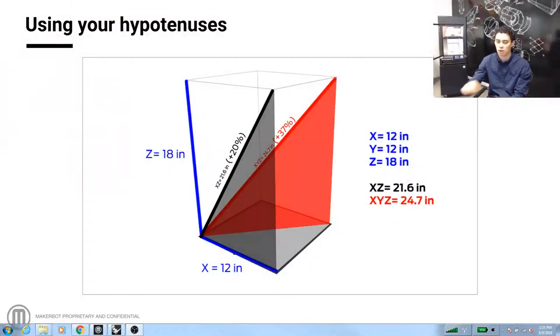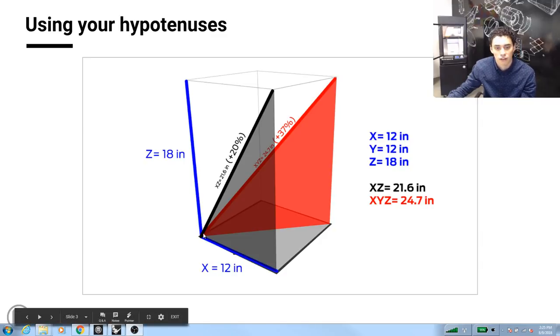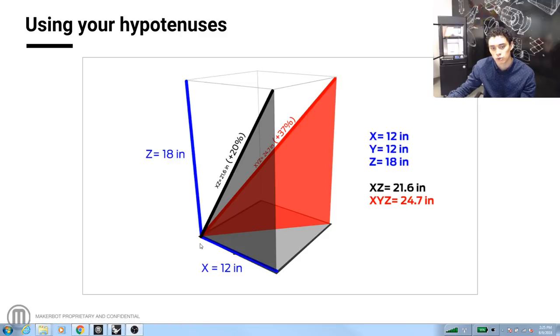And in MakerBot printers, that's set up to 65 degrees. Luckily, this line is way less than 65. It's actually right on the border. It's around 70 degrees when you trace that second hypotenuse. And by second, I mean I'm calling the first hypotenuse the one that's just the x-axis versus the z-axis, and then the combined one, the one that goes from one corner of the printer to the very outermost corner of the printer, is the second hypotenuse.